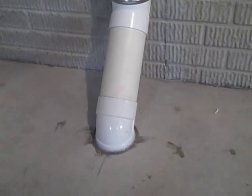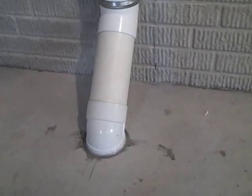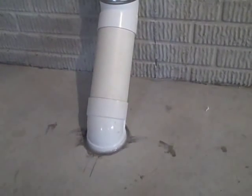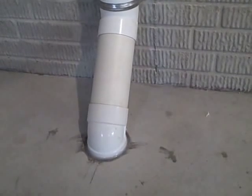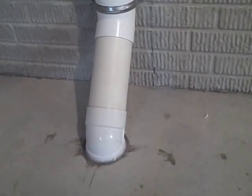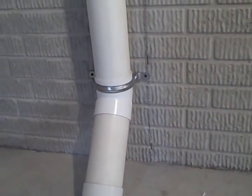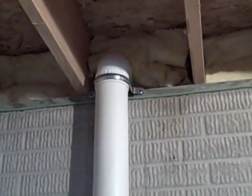That gave us an excellent spot to extend our pressure field all the way around the entire basement perimeter. We also find permeable soil underneath this basement floor — a very clean gravel. When we find gravel, we can move lots of air, which generally means lower radon levels. You see our clamps there; the system is clamped to the foundation wall at the suction point and again up here at the sill plate.